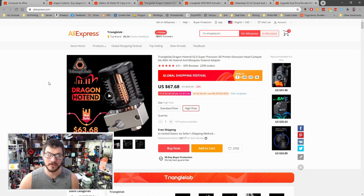This might end up going on one of the upcoming printers that I'm going to be doing. I'm thinking about maybe putting one of the mosquitoes, the high flow mosquito, on the BLV, maybe, just if the V6 is going to continue to give me issues. I pretty much solved most of those issues though, but thinking about maybe trying that out, something different. Both of those can be direct drop-in replacements for a V6 for the most part. This definitely can be because it's the same profile, but the mosquito might require a little bit different fan mount or clamp mount, whatever it is that you're using.